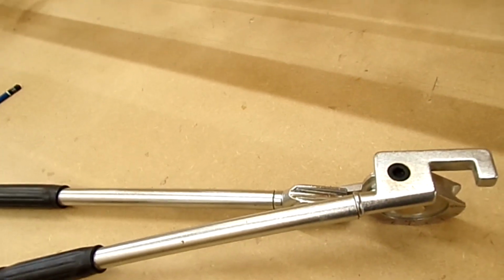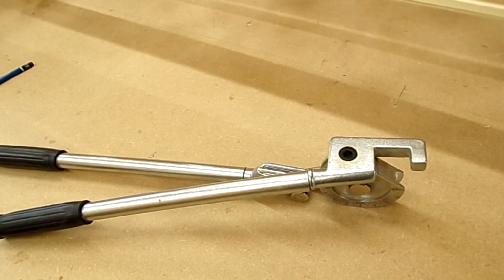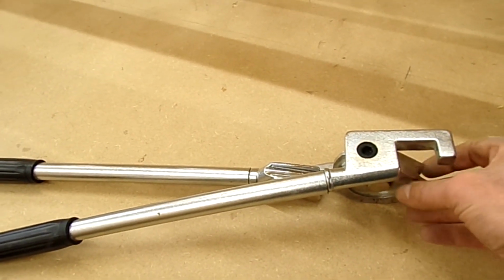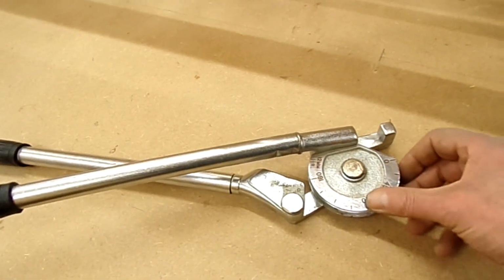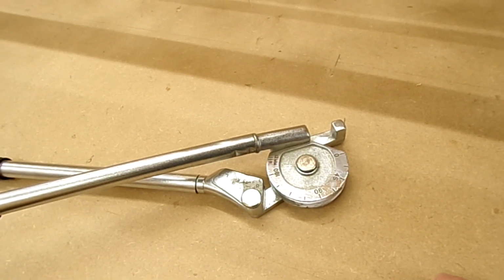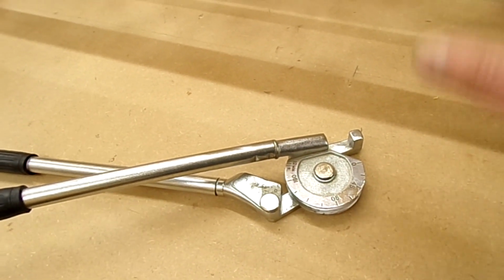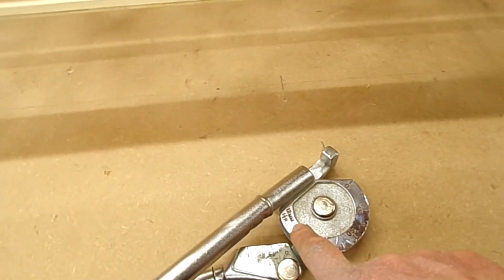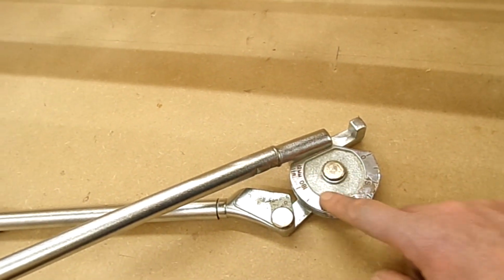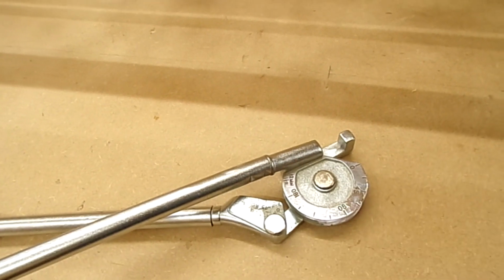So now I've got a bender, so I can do a nice bend rather than trying to just do it around some form of former, which is not my preferred method. So I've got a tool now which will do the job just fine. Luckily it's made out of a light alloy, so it's easy to sort out. Cheap and cheerful, designed for 12mm, so I've had to bring it up for the 12.5 or just over 12.5mm for the half-inch pipe, which is what we're using.